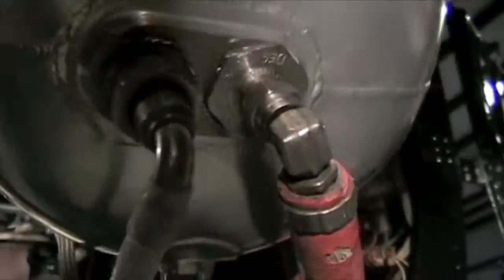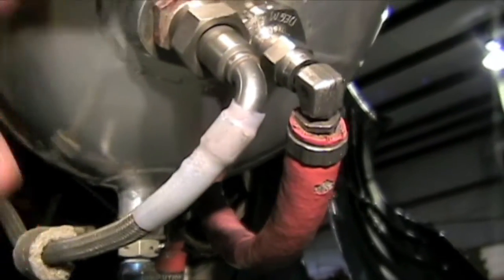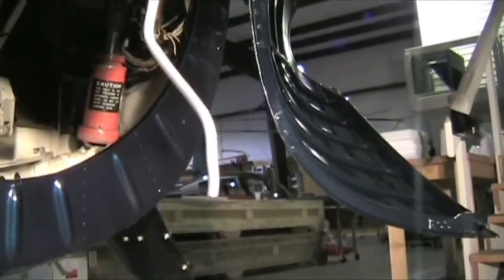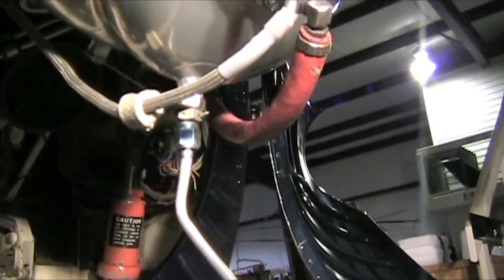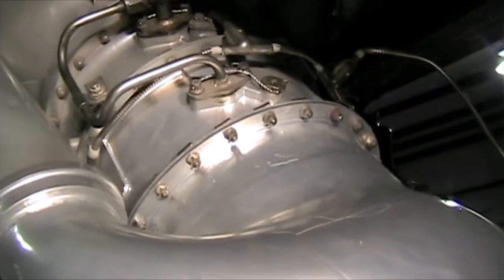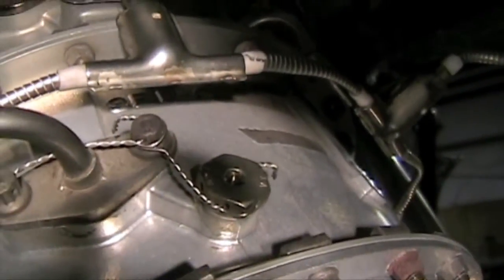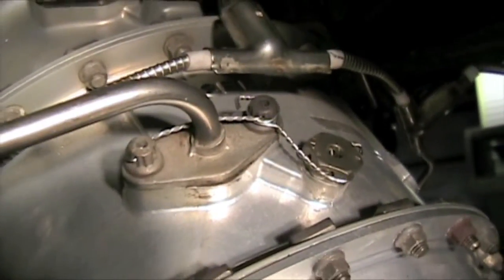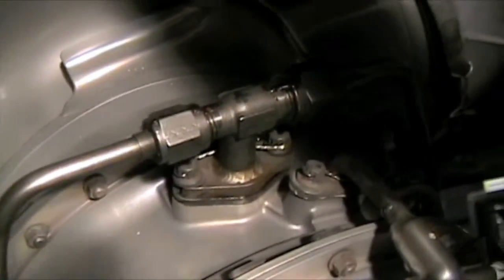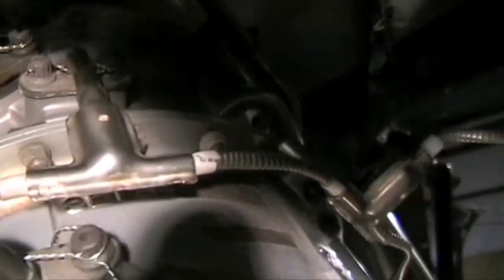Make sure the safety wire is installed on the igniter, and here's your fuel line — make sure there's no leaking and everything's nice and tight. This little silver line coming off the bottom extends through your cowlings; it's a drain for excess fuel prior to startup so no fuel is present when you try to light it. Coming up the combustion chamber, make sure all the bolts are properly installed and tight. Here are oil lines — make sure safety wire is on there. With the fuel lines, another fuel inlet — make sure the torque stripes are on those couplings and safety wire is in place.